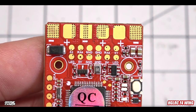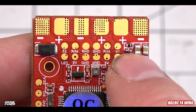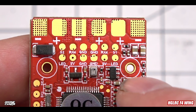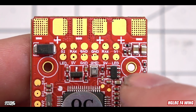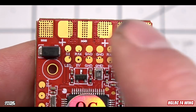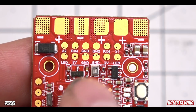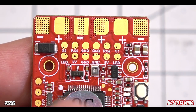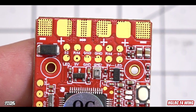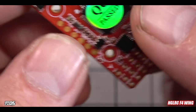Signal S1 goes here for motor one, S2 for motor two. There are also spots for extra 5V, two grounds, and options for LEDs — looks like two sets of LEDs so you could light both sides of your wing. Let's spin it around and look at the bottom rail.